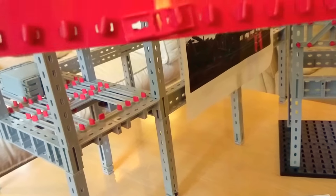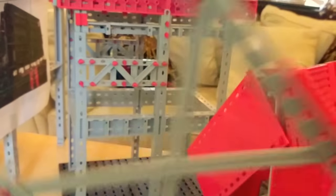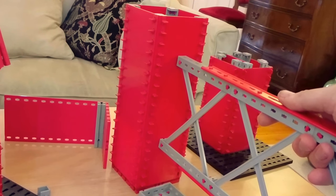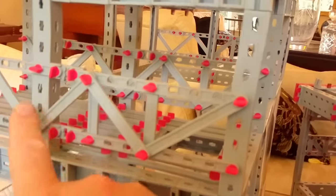That beam is incredibly rigid along its whole length. Any settling of the middle column would try and bend that beam, and of course all it would do is throw a lot of weight onto the front column and the back column, one of which had been heavily pre-weakened. By back column I mean the one nearest the chimney side of the building, not the control room. You can see that they've added trusses — attach a truss to the column solidly and that makes the building more rigid. You can see them on the end of the building when you look at pictures of the wreckage.